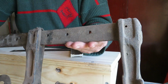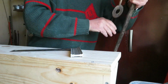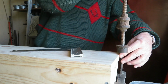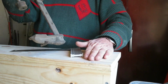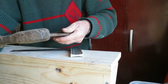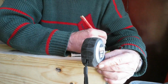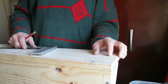This is the biggest and heaviest clamp I have. We must place it with its leg just inside the wood shelf, not much more than this, and the head sits at the back of the rack. So we measure the leg 4 centimeters, and just over this amount is the length of the cut. Not much more than that, so we don't weaken the wood.